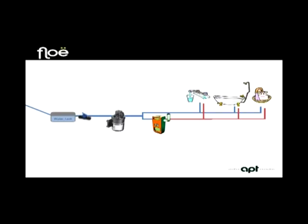Seen here on the bigger picture, you can see where these two components are fitted. Now, although we recommend fitting them before the pump, this may not always be possible. So try and fit the components as close to the pump as you possibly can. At the end of the procedure, we can pressurise the system, open the shutoff valve and push whatever water is in the pump and the lines leading to the shutoff back down into the water tank. Now, some pumps don't allow water to be pushed in reverse, so by running the pump dry after the water tank has been drained, any water in the pump will be pushed out beyond the T adapter and therefore pushed out of the taps.